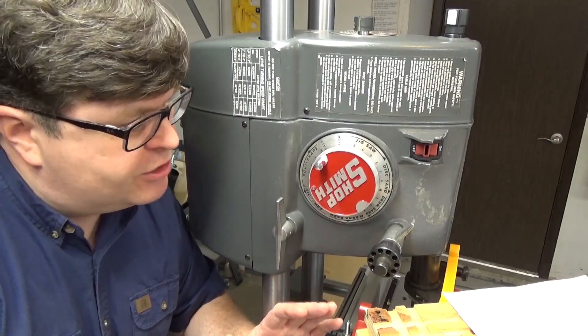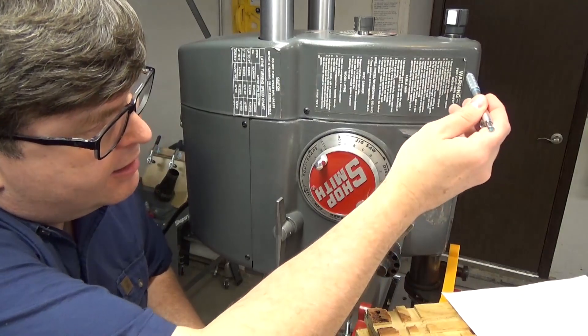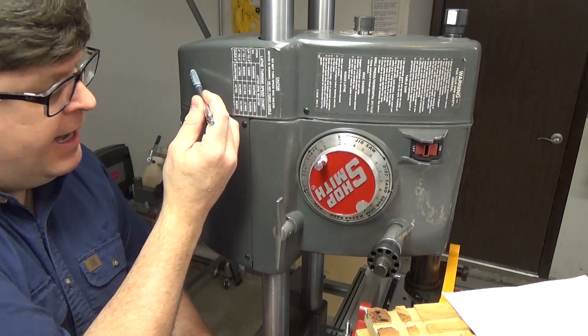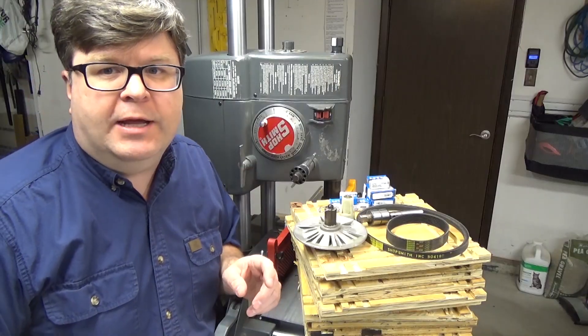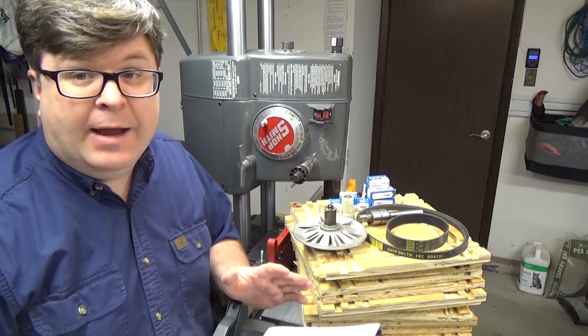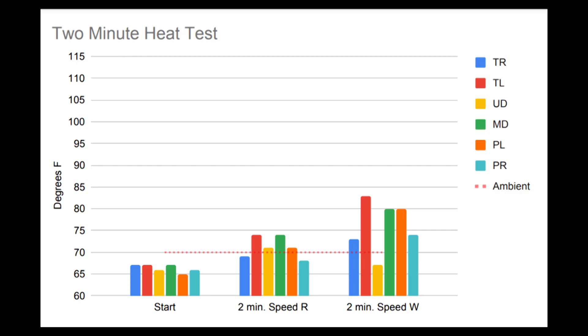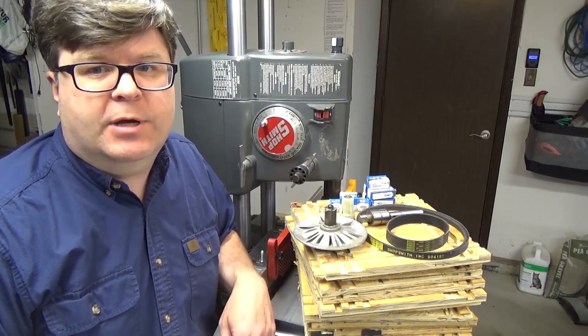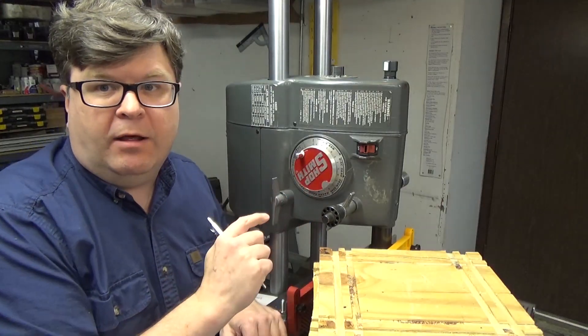Each time I took a temperature measurement, I took a reading at the top right, the top left of the headstock, the upper drive, the mid drive, the left pan, and right pan. As the chart for the two-minute heat test shows, I don't really have a heating problem within that two-minute time frame. With an ambient temperature of around 70 degrees and a starting temperature in the mid-60s, after two minutes of running at speed R I saw a moderate increase. With an additional two minutes running at speed W, there were some additional increases, but really not that much. So it appears that I did solve the excessive heating issue within the first two minutes. After my headstock rebuild, everything ran a lot cooler.